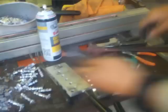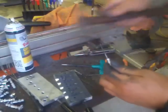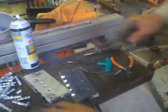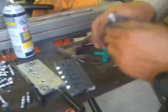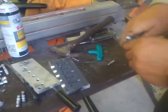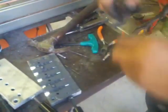We can take one of these that's cooled and nick it with some diagonal cutters, and we now have a complete line-through swimbait insert. Now this is dead soft lead, so I suspect you might have slightly better luck if you were using wheel weights or something with some Rotometals hard lead alloyed into it, but a little bit of clean up on the eye of the weight isn't bad.